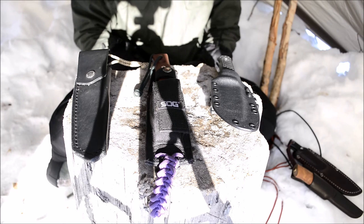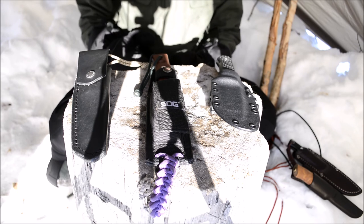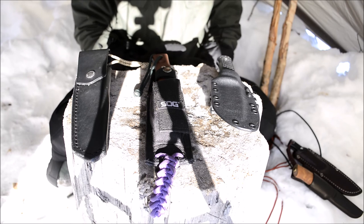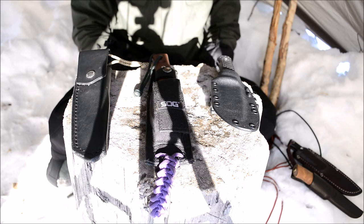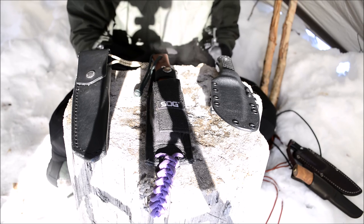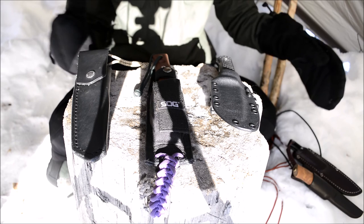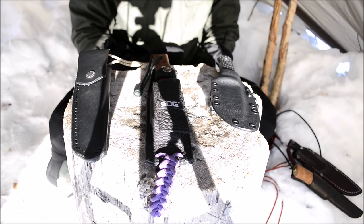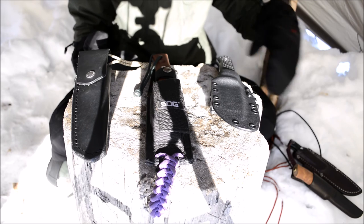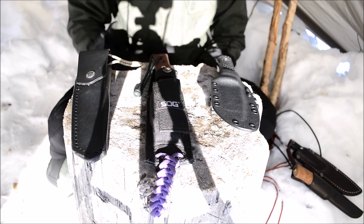The biggest disadvantage of 1095 is how easily it rusts, and you have to be super cautious with it. That said, 1095 is very picky about heat treat — how well it's heat treated determines how well it holds its edge. But generally there's very good heat treating available nowadays, so most 1095 knives hold their edges pretty well. Resharpenability is very easy; 1095 will take a razor's edge very fast. Because it has so much carbon — and carbon is very pliable — it resharpens easily, whereas chromium in stainless steels does not like to be reformed, making CPM steels harder to sharpen.